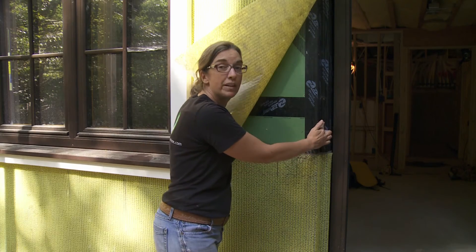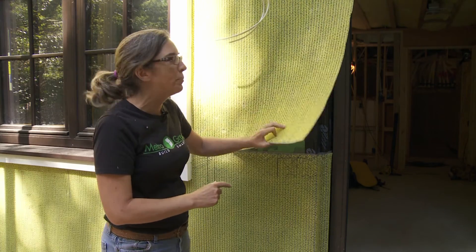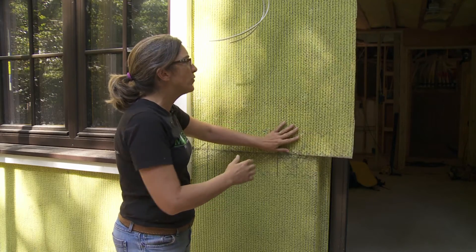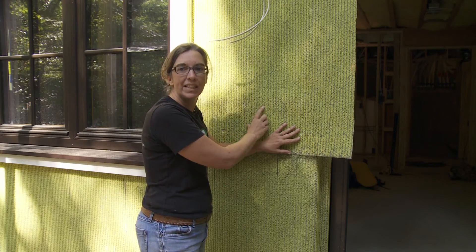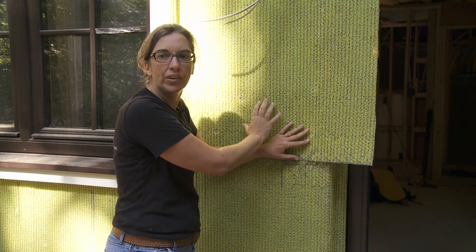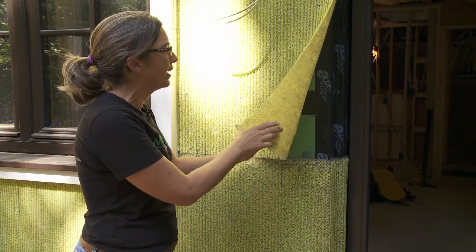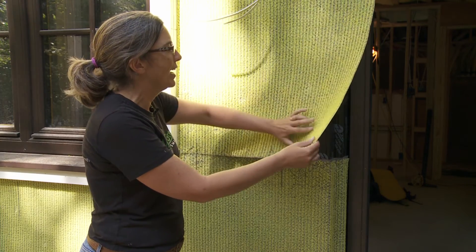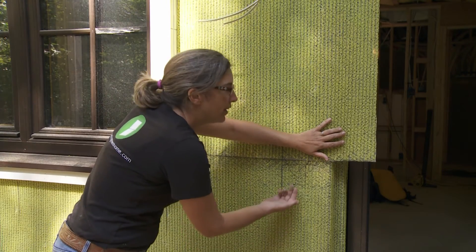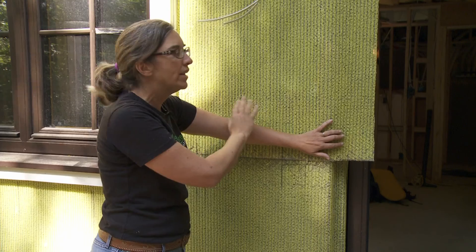This tape follows around to every door and every window in the house. Now we're ready to apply the siding, but first we need to put a rain screen on. This is a really important thing and it's becoming a best practice in building today — to make sure that your siding is not all the way up against your house. Because if it is, wind-driven rain will get through that siding and sit up against the house. So we want to let the siding sit off the house a little bit so that it can dry out. This is a very simple product — you can see it's a yellow plastic mesh. It provides just about a quarter of an inch, which is just enough to allow air to flow from down underneath the house all the way up behind the siding to the top. This runs continuously all the way up and then the siding goes over it.